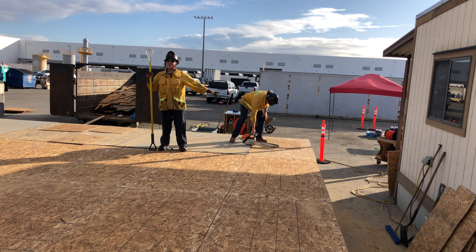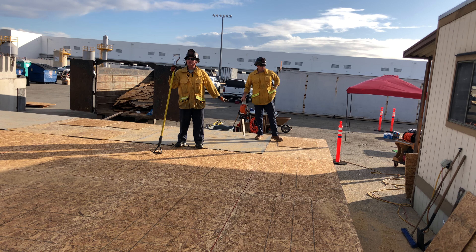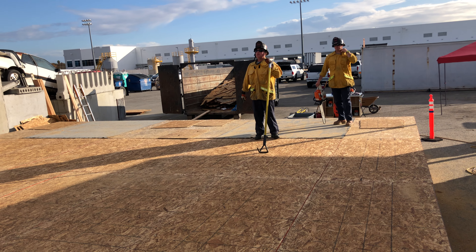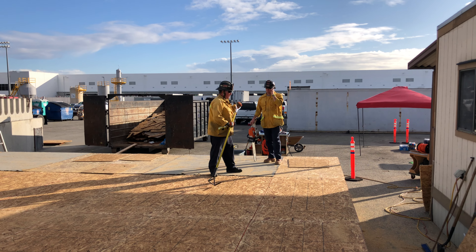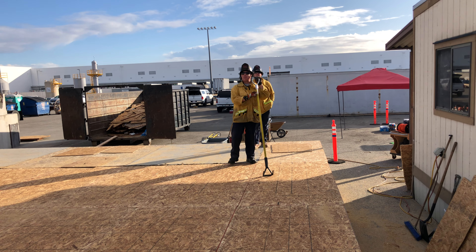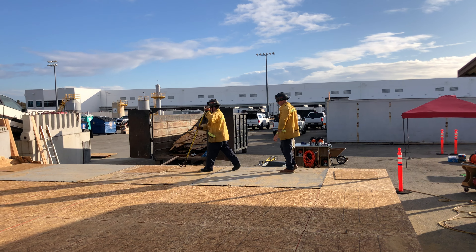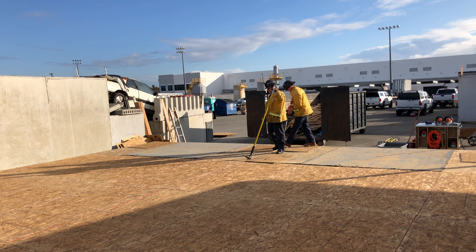This inspection cut is prop-driven — we are not advocating doing your inspection cut in the corner of a building right on the bearing wall. In a real-world scenario, if I was going over there to ventilate, I'd have Greg out here doing his inspection. If this roof continued to the west past this beam, I'd probably have him cut right here or right here, and we can identify the beam and purlins as well. We got rafters two feet on center.